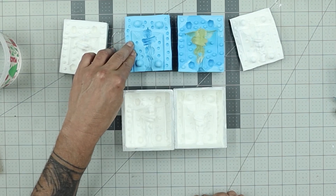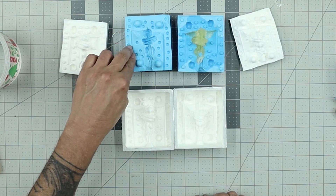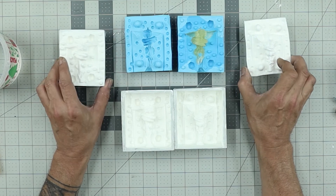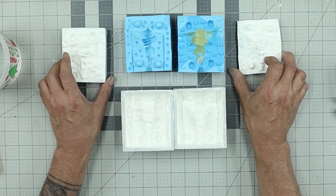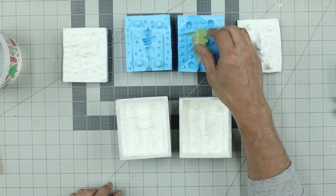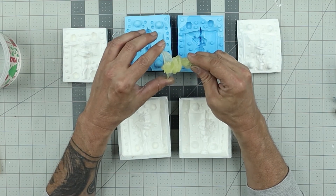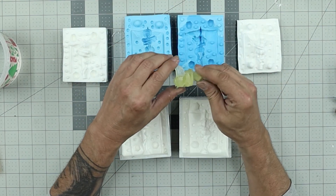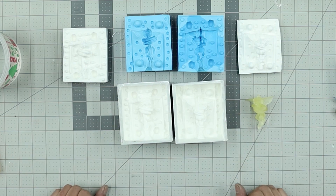The silicone I used in this is Casta Mold 30 TF — this is an eight-hour curing silicone with a 15-minute work time. These pieces here are done with Cast 50 — fast curing time, 2.5-minute work time, and demolding time is 10 to 15 minutes depending on your climate. This little guy in the center is cast out of Flexit 90. If you're looking for a flexible resin that is not going to break when you drop it or throw it, Flexit 90 might be the resin for you. This is Specialty Resins — have a good day.